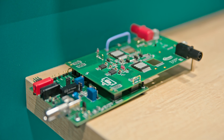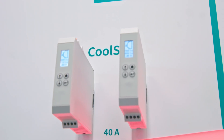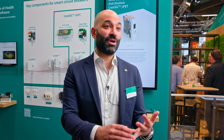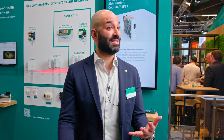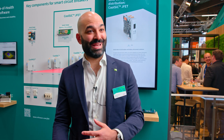This new JFET is for DC-type applications, for constantly-on applications. People wonder what type of application that is, and the answer is solid-state power distribution — solid-state circuit breakers. Look at the infrastructural changes coming: a lot of green energy sources are all DC — battery backup systems, wind energy which ends up as a DC output, solar which is DC. A lot of these DC grids are unnecessarily converted to AC and back to DC, so why not go straight DC? But if you go straight DC, a classical breaker faces a very different fault scenario because DC doesn't have a zero crossing.